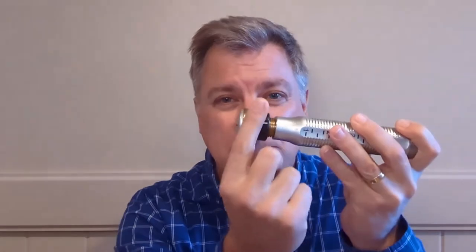Also, installing an institutional sprinkler head on an exposed pipe does not meet the anti-ligature requirements. We may have a more tamper-proof sprinkler head, but the exposed one-inch pipe does present some challenges.